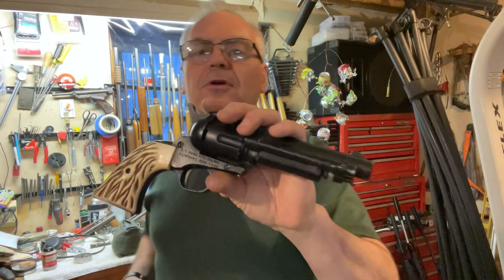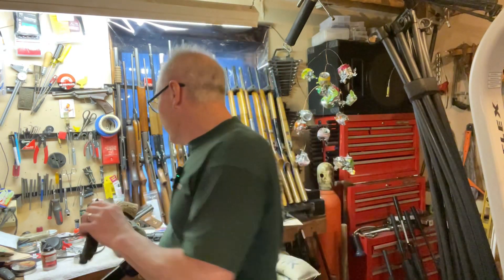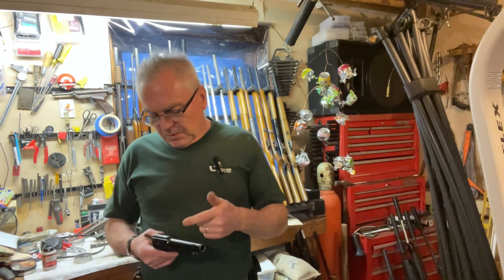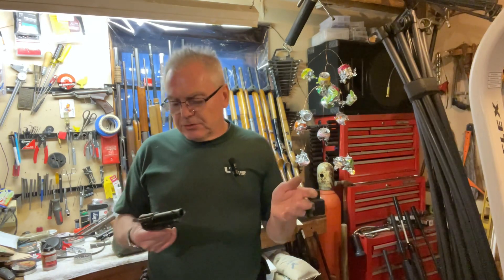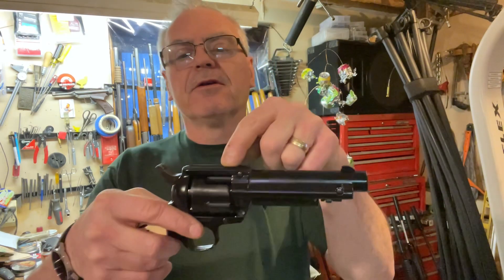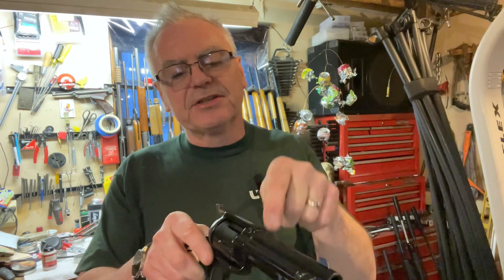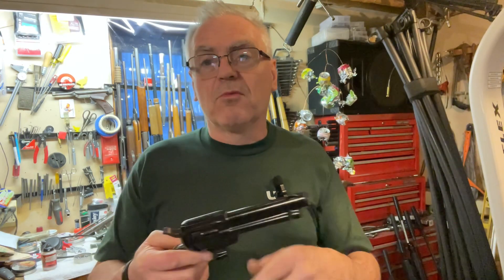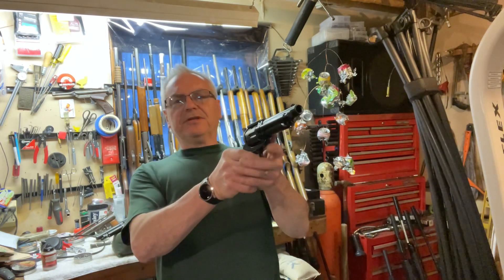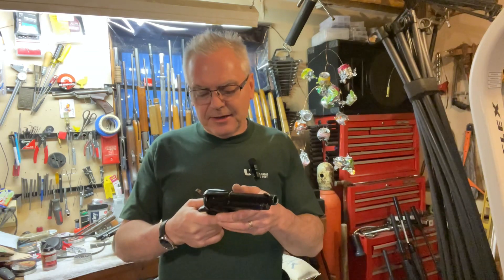This is not the first one I have. I do have another one I've had for quite a while, and I sent that one into Henry Ford and he did reseal it — that one's shooting really good too. We're going to shoot them both out here. This one had a couple of minor issues. The main one was a little tiny spring up under here that has a little nub at the end that sticks down into the barrel, keeping BBs from rolling out until you shoot. That was bent up, so if you didn't have the barrel tilted up, the BB would roll out before you got a chance to shoot.